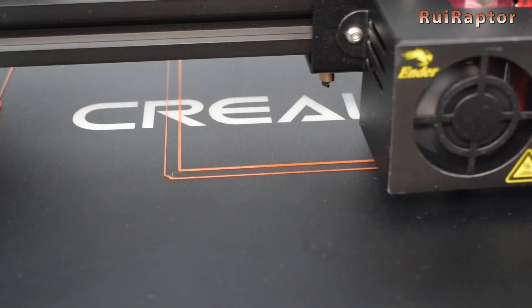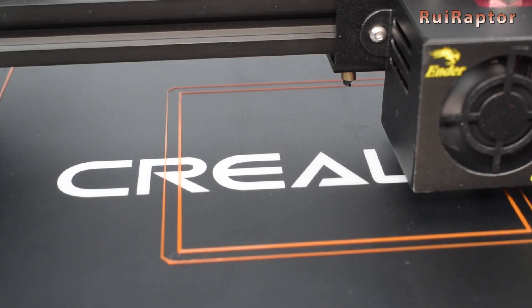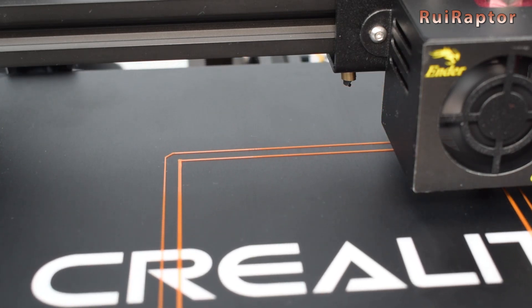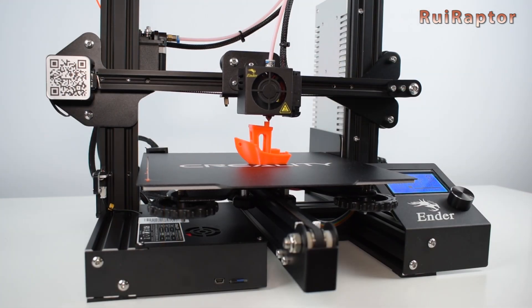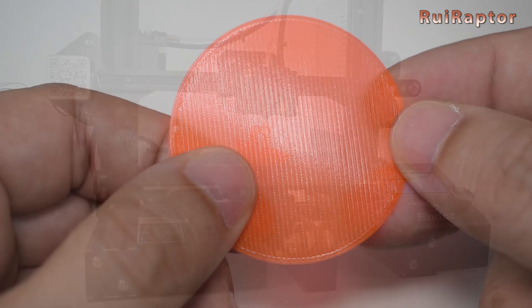Turning on the brim in the slicer is also a good idea, because the printer will start with the brim and you can use that to confirm that everything is okay before it starts to print the actual model. As we mentioned earlier, there are several things that can mess with the leveling — so if you decide to use the manual mesh leveling, we recommend that you run the leveling sequence often to make sure that you are using a valid mesh.